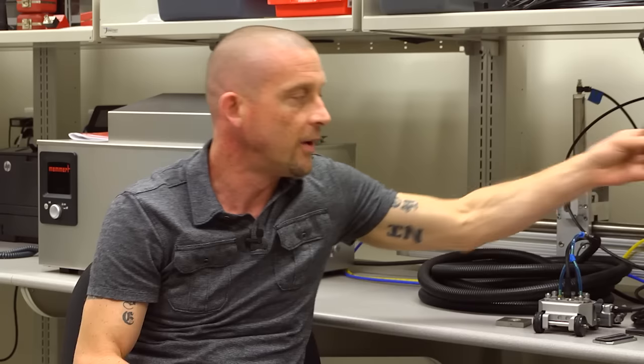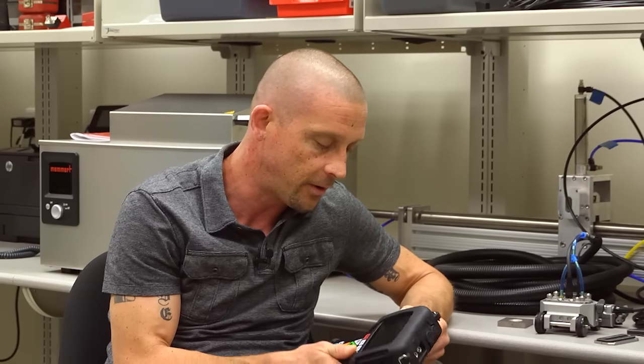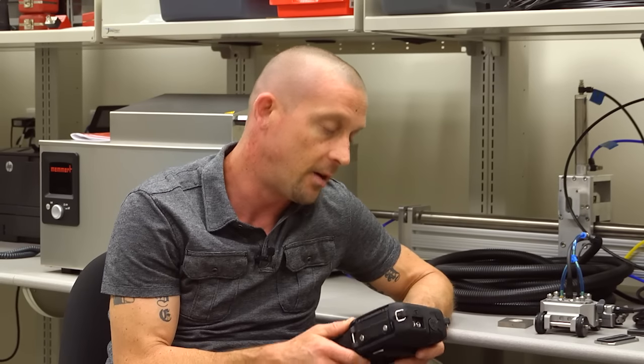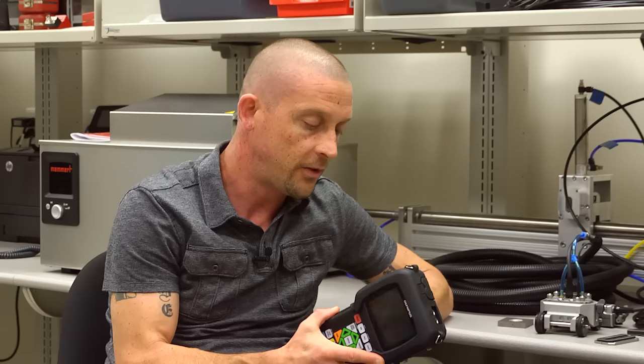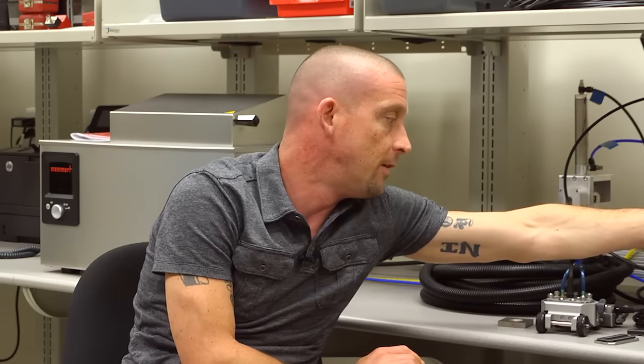Traditionally, what type of corrosion solutions did we have? Well, most of our customer base is doing one of two things. We have the 38D Plus, which you're very familiar with here — it's been one of our long-standing thickness gauges. This is usually done either as a single point measurement or we take multiple point measurements and data log them into a database for remaining wall loss analysis. And then on the high end of the market, they've been used to very rapid, fully automated scanners connected to a PC-based corrosion mapping system, typically using a dual crystal and a very high-speed XY raster arm.